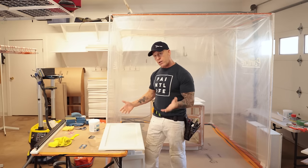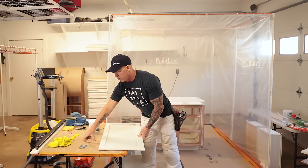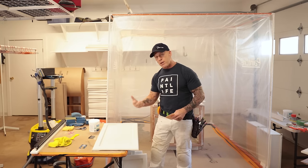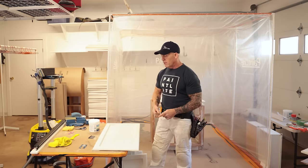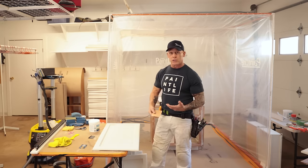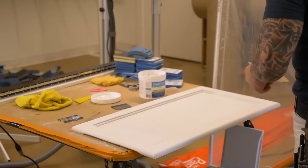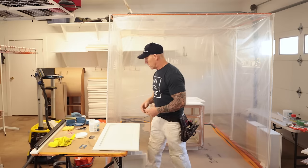These are oak cabinets, very similar to the ones that we got, but we're going to start applying our aqua coat, and it's just going to take a little bit more time and a little bit more inspection and really looking and being careful where you go, and then making sure you scrape off enough of the aqua coat so you don't have to do too much sanding. So here we go. Me and Michael are working on these. So let's get to work, Michael.